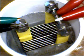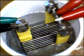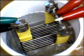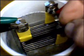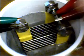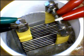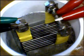238,000 times greater than what the calculations predicted. And when I went back and checked a couple of plates around the black urethane adhesive, which had already been cured, sure enough, it is an electrolyte unto itself. So the black urethane adhesive that runs along both sides of the plate column that secures the plates together has a zero gap between the plates. Apparently the black pigment is conductive, although you cannot measure the resistance through the urethane adhesive, and it makes the overall capacitance value of the cell completely unpredictable. That was unfortunate.